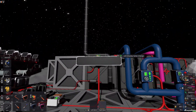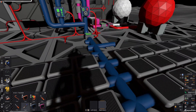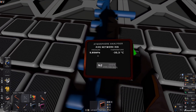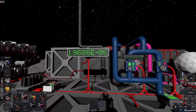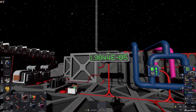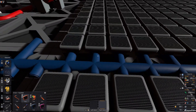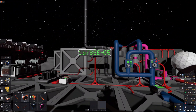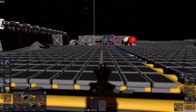I have my handy little display here. This number is the rate of change of the temperature in the pipe. I could just stand here and wait for the temperature to change, but this is better. It's a really small number but it's positive, which means the temperature is still increasing inside the pipe — so I don't have enough radiators to deal with the heat.